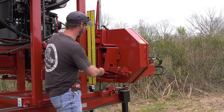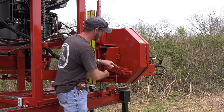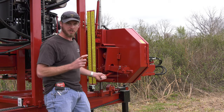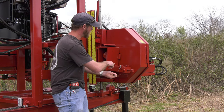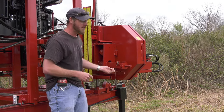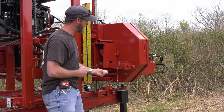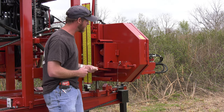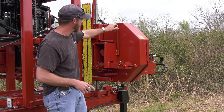And then whenever we're increasing our tension, it is done on a jack and we're compressing this spring down. So I am measuring tension on that blade by how far I compress that spring down. And we've got a little key stock up here and I want to crank that till it touches our wire. Now that'll be preset from the factory. And whenever my key stock gets to that wire, I know I've got correct tension on the blade. And it's set and I'm ready to saw at that point.